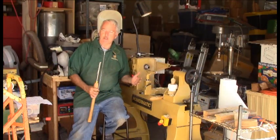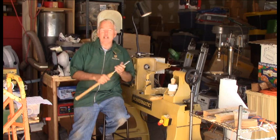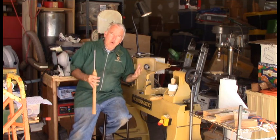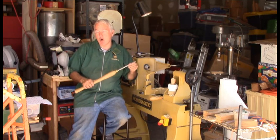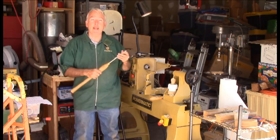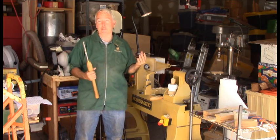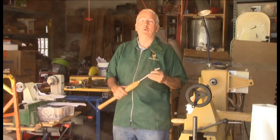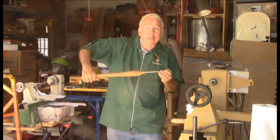So I used a tall stool so that I could sit on the edge. And I kept the edge of the tool still against my body. And my tool movement was actually more difficult, but since my project was very small, I really didn't need to move very much. And I could quickly step away and push the stool out of the way, or even let it fall if necessary. If I were hollowing out a bowl, I would not sit.